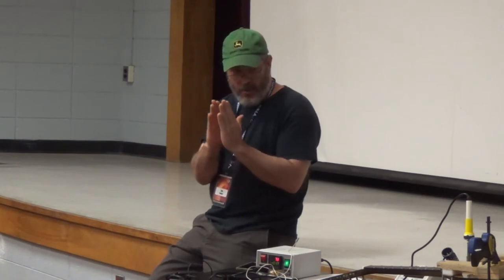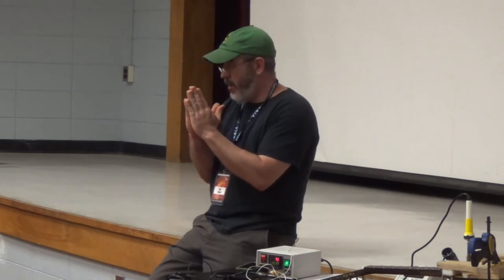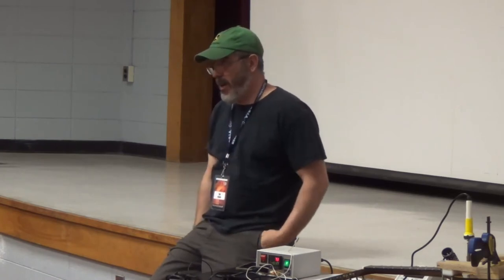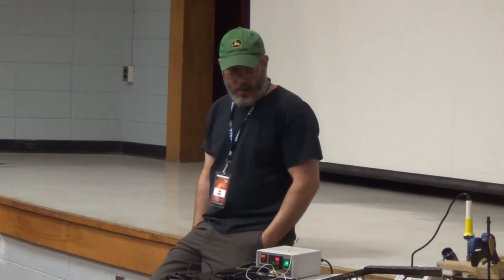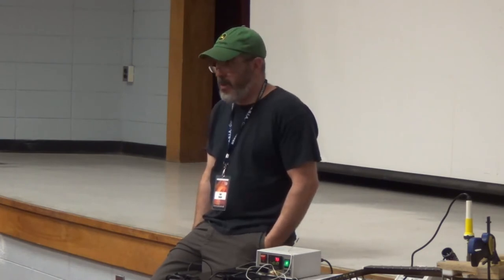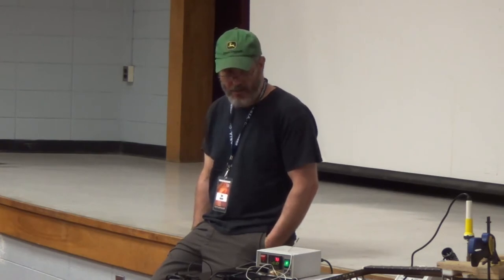This is another thing to think about too: as Martins get older, that gap starts to shrink. I don't know if any of you have ever pulled a 30s Martin, where there's virtually no gap between the mortise and tenon, and it's almost impossible to get steam going throughout that joint as well. I've had those guitars take five or six hours to pull without cracking the heel or blushing the finish, and you're just trying to be ginger the entire time.